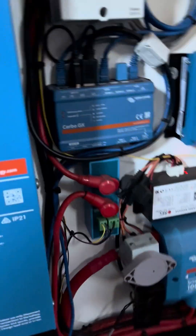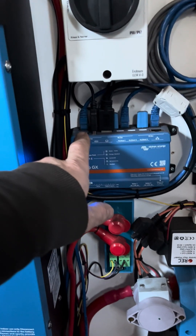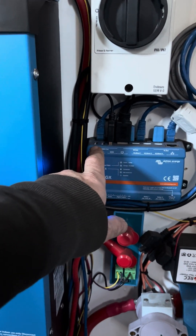It uses a Cerbo — you have to have a Cerbo fitted. There's a single CAN bus communication lead between the BMS and the Cerbo, and the Cerbo is not just there for monitoring — it actively controls a MultiPlus and SmartSolar controller, in a similar way that the Lynx system does. So it's got all the advantages of the nice Victron system.